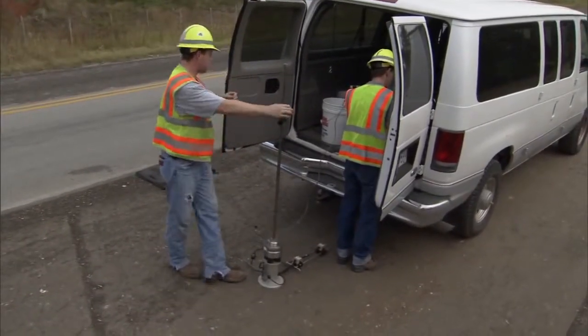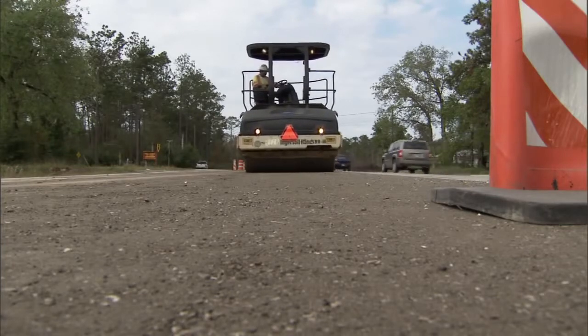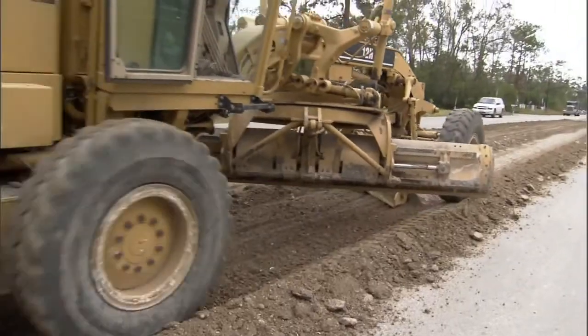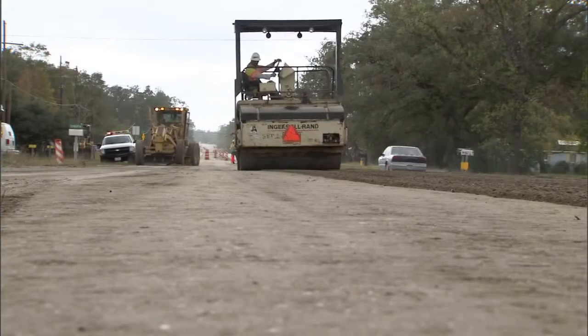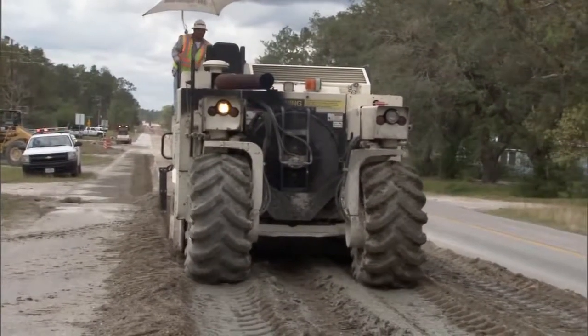Some of the issues with it are traffic control, because we're constructing under traffic, so there's going to be a while where traffic is driving on an unfinished surface. But we usually limit the amount of unsurfaced road we have, and some of the larger districts have concerns with that, but we typically limit it where we construct within traffic to lower volumes, say 2,000 ADT or less.